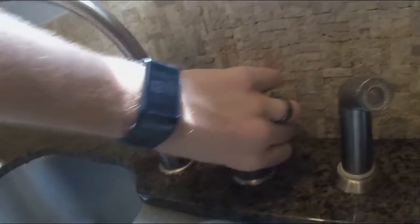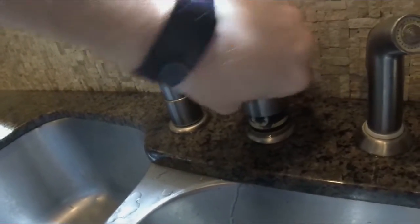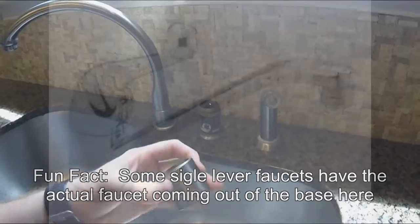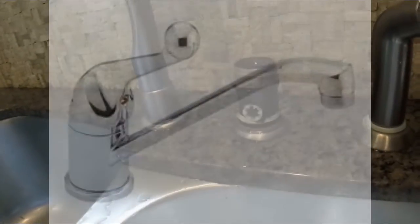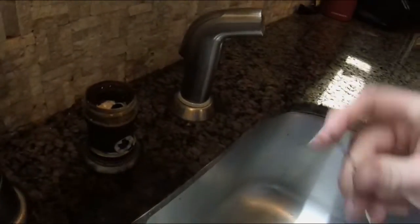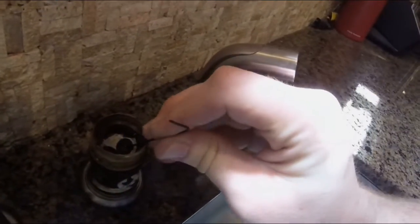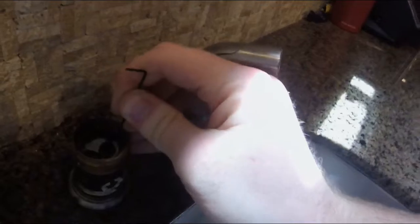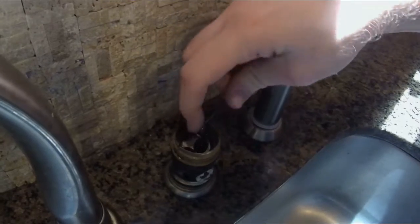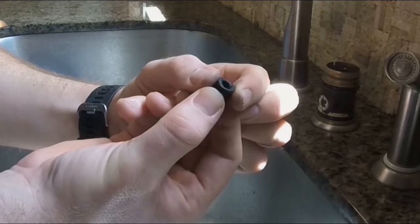The best way to drain the water is to grab the ornamental collar at the bottom — once that O-ring seal breaks, the water will just drain out. Go ahead and remove this ornamental collar; it's just for decoration to cover up the plumbing. You can see there are a couple of O-rings on it that we'll replace while we're in here. Now that the water's drained and the ornamental collar is out of the way, take a very thin Allen wrench or a pick and lift up on this O-ring, prying it out gently. It comes with a spring.